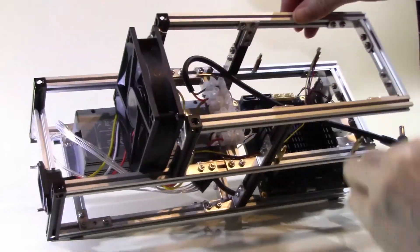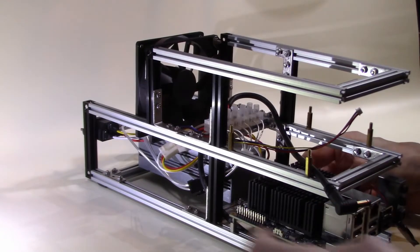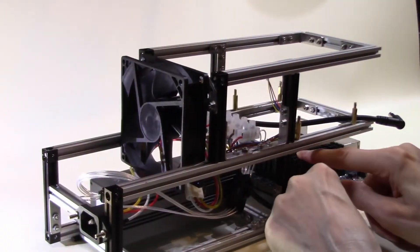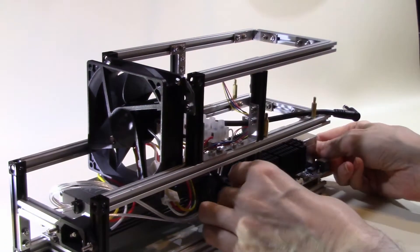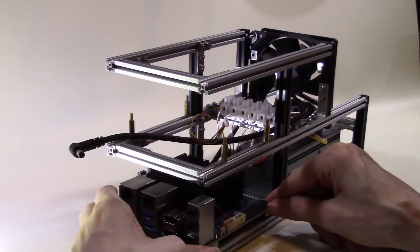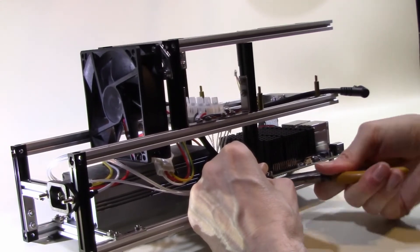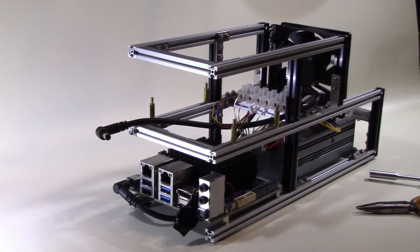You can see that the Odroid supply cooling fan is in fact mounted at the back of the frame to almost silently move air through the frame to cool the Odroids. It's an active fan connected to the lower Odroid and uses a miniature connector to the motherboard. I'm really impressed with the quality of this fan — it runs almost silently and only powers up when it needs to. There we have the first Odroid fitted, so now it's time to look to adding the second. The last thing to do on the first Odroid is to connect the cooling fan to the miniature socket on the motherboard.